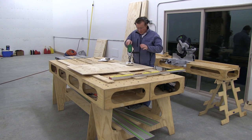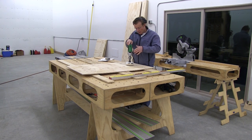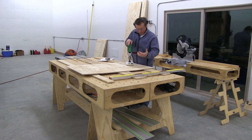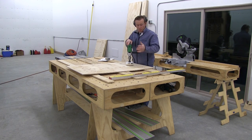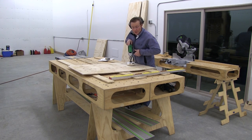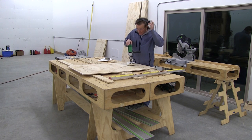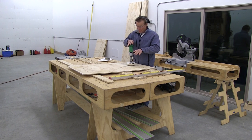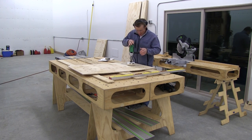When you're turning in these big bits, you want to make sure you have a handle on it and really grip it, because with all those teeth grabbing the surface all at once, it really wants to yank the piece around. You could clamp the board down as well, but it's good enough with me putting my body against it and really hugging the drill for a little extra safety. Without this, you'll find that when it grabs, it can really rip it out of your hand and hurt your wrist or cut you.